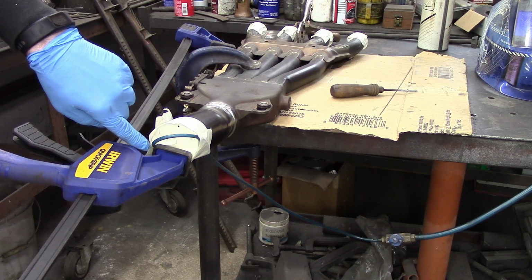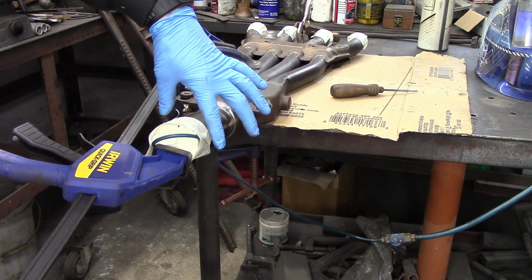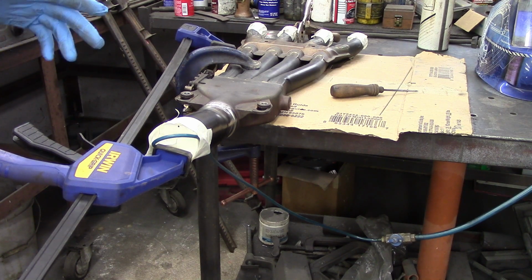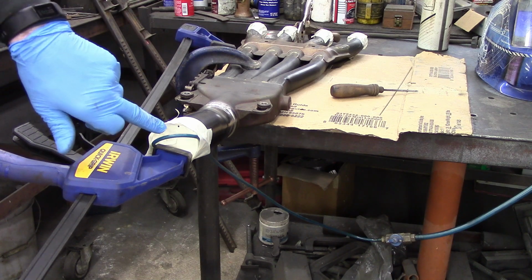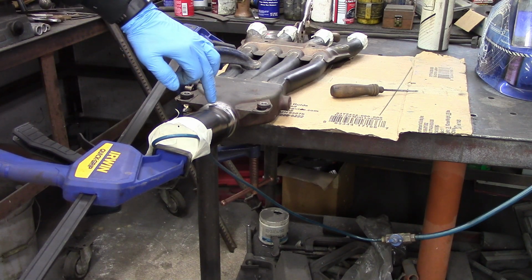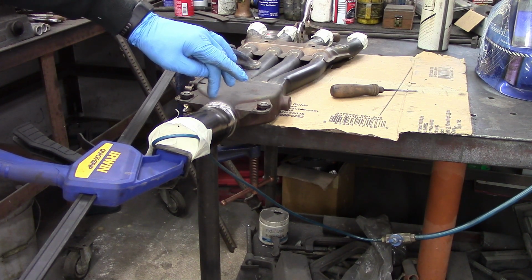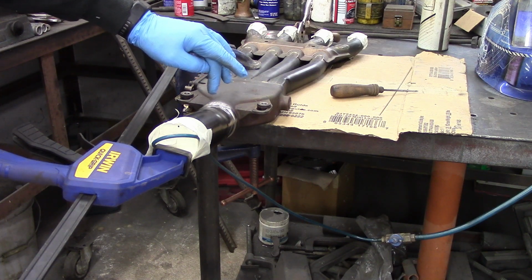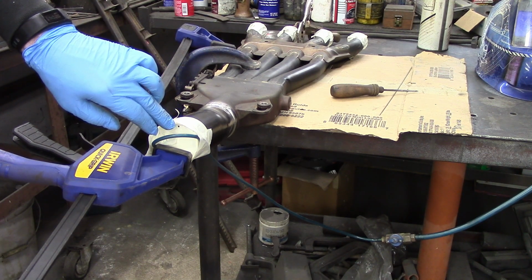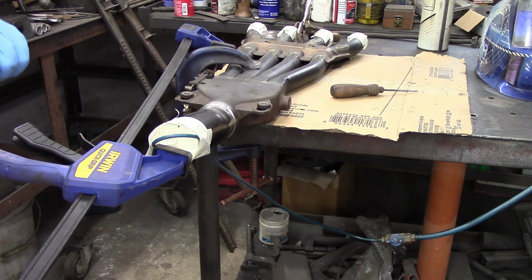The purge hose is going in on the bottom of this painter's tape, and then this piece of tape is just holding the purge hose so that it doesn't fall out while I'm welding, because that would contaminate the weld, as that would mean that atmosphere and oxygen would get inside. Now, argon being heavier than air is always going to go to the bottom of the area. So if I'm welding on the top side here and there's no argon up there, it's not purged out, then it's going to get sugar on the inside and it's going to get contaminated. So I have a very small hole pierced in the top of this painter's tape so that any atmosphere and oxygen will bleed out through that hole.